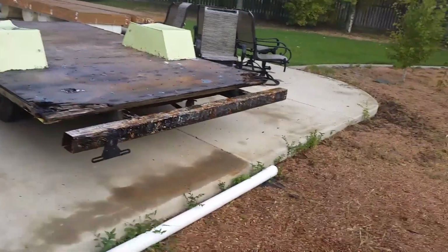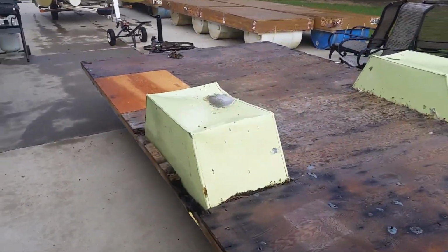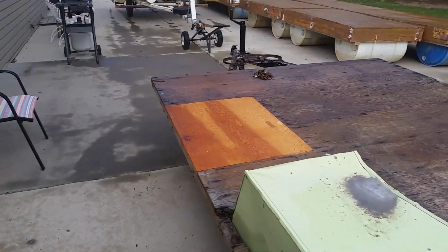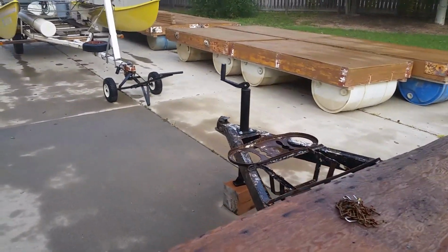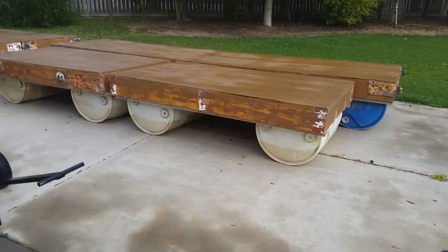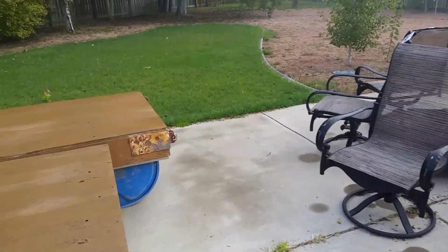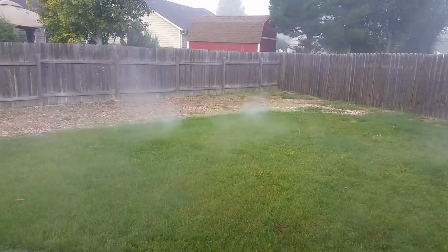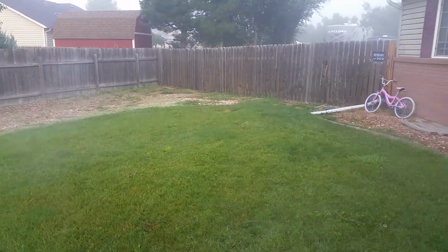It'll take a while though, because like I said, my compressor's not big enough to just constantly run and blow sprinklers out. I can't lose that much air. So, and when only using 40-50 pounds, the air alone cannot keep the sprinkler heads up. So once the water's gone, they usually drop back down. There's 3. I didn't get out here in time to catch the water.